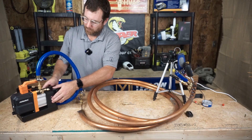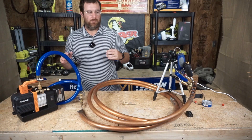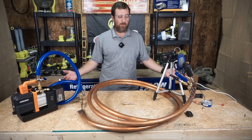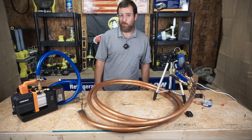I'm going to shut the pump off so we can hear a little bit better. We're going to come back in around five minutes and see exactly where we're at in the decay. And if we're good there, we can have a lot of confidence that our gauges are actually reading what they say they are, which is a good thing.